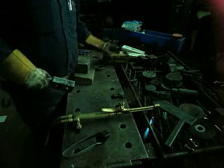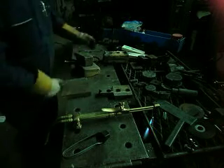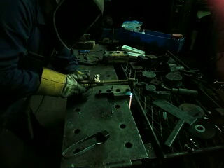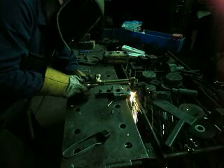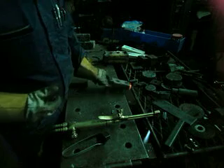Here's a piece of one inch. We'll attempt it with the same settings. This is kind of pushing things — 40 PSI is a little low for one inch plate in my opinion. Notice how I didn't get full penetration. Just not enough oxygen pressure.